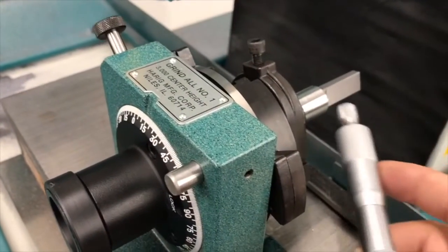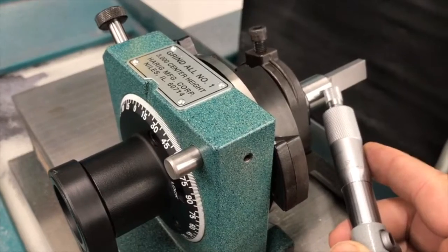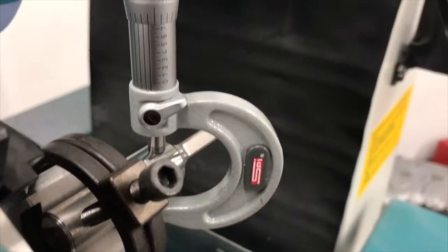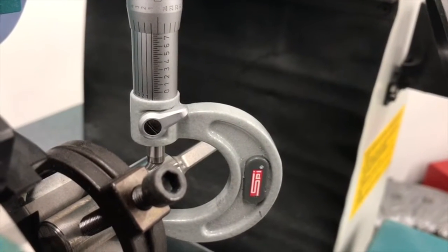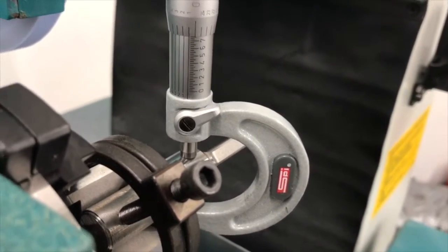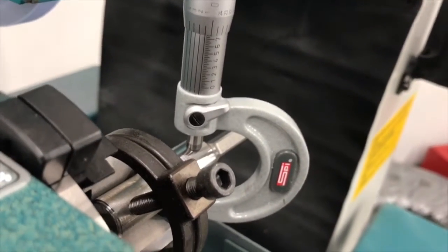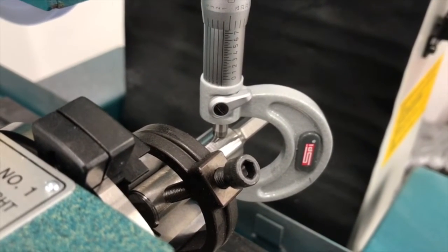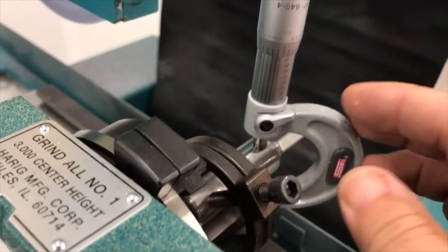I'm going to take 2.5 thousandths off because this right here reads off the radius. It's like an older lathe that reads off the radius. Taking an additional 2 thousandths off now, and I'm at 751, so I'm 1 thousandth away from where I'm going for. So I need to get that additional thousandth off there. So once again, just because this machine, the way it's grinding, it's going to read off the radius. I'm going to take off that thousandth by taking off a 1/2 thousandth.